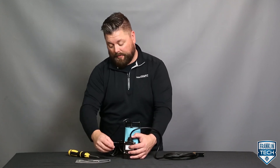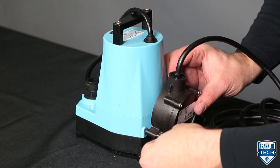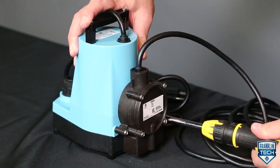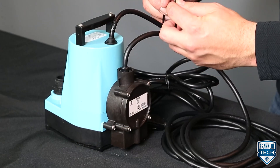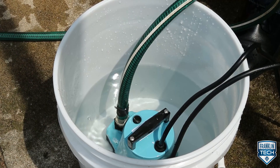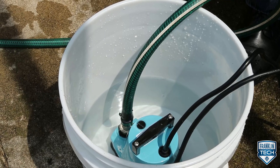Let's start with the physical installation. Attach the RS5 directly to the pump housing of the 5 MSP using the provided screws. Use the provided cable ties to secure the power cords together. Place the pump on a solid surface in water at least 1 inch deep for proper operation of the pump and switch.